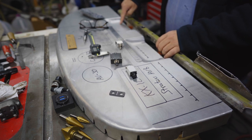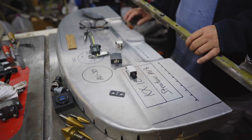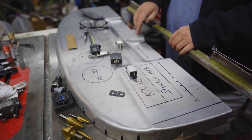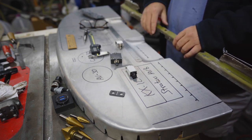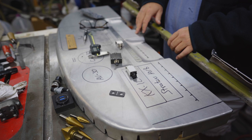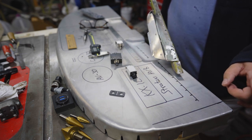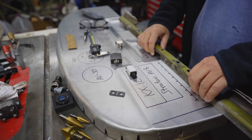I'll have some cables going through on this side into holes like these here. And there's a nut on the back, so that'll add some more rigidity. The throttle will go through the middle, and that'll also hold things together. And behind that a 45 degree stiffener goes at an angle up toward the firewall and ties into the engine mount where the 4130 chromoly tubes come down from the wings and tie in. So, and then on the edge of this, on both sides, there'll be rivets that tie it to the airframe, to the sides of the fuselage. So that ties everything together.